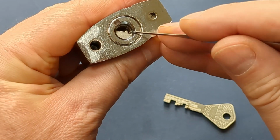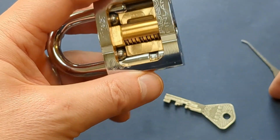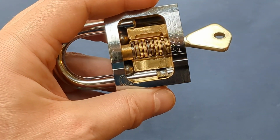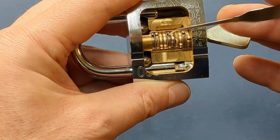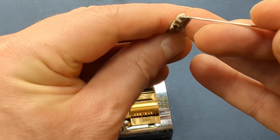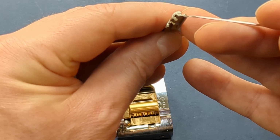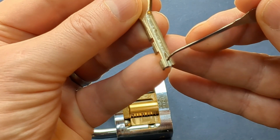So you can see this one, it's got a big tooth on the right hand side of the keyway there, and a bit of a shelf. Now all three of those profile plates do different things. They're all different shapes. The one at the back, and this is the most common format, has a tooth on the outside, looks like this, and the one in the middle just has a sort of shelf on it, and then of course the one at the front has a tooth at the bottom, and those correspond to features on the key. So that cutout in the key goes with the tooth on the front. You've got the shelf that extends quite wide and limits how much key you can have either side, and then the tooth on the rear plate on the key corresponds to that.